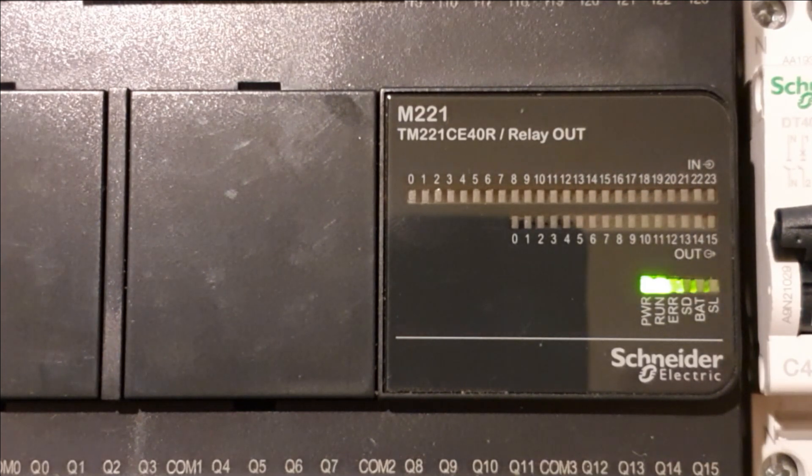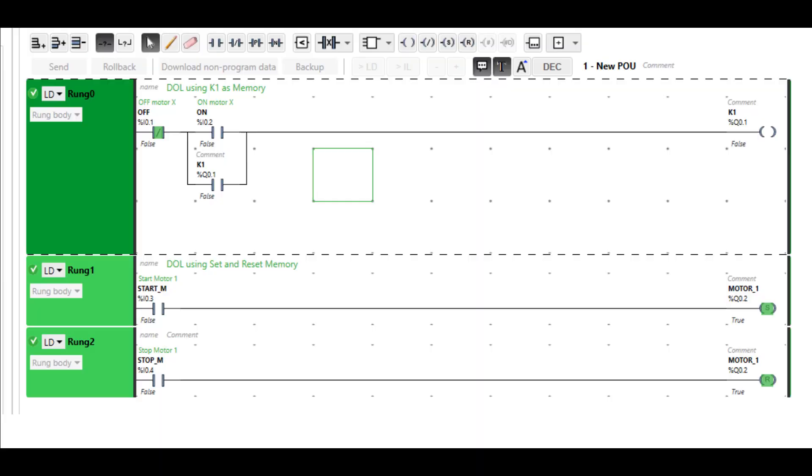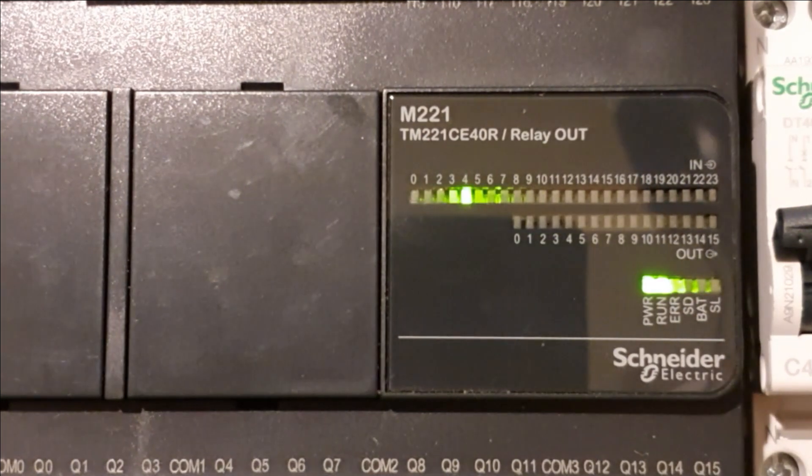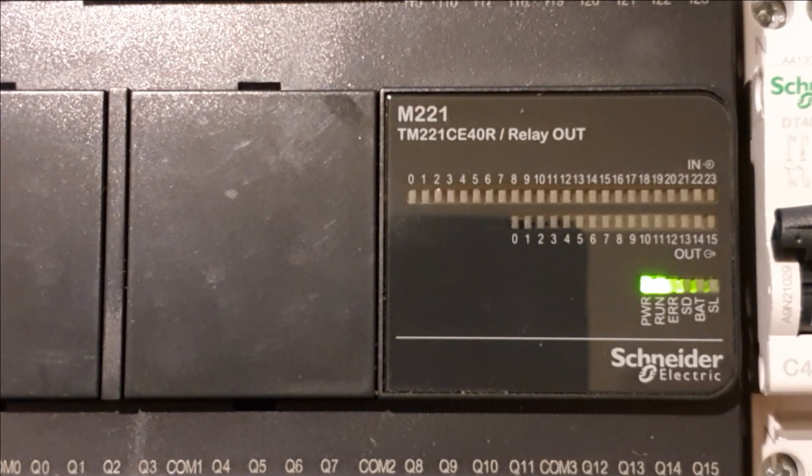This is the first rung — rung 0. Now I will show you the set and reset memory using SR. This is rung 0.1. The connection is made on input 0.3 and input 0.4 — input 0.3 is the SET and input 0.4 is the RESET. I activate input 0.3. As you can see, even when I remove the signal from the switch, Q0.2, the output relay, remains ON. To reset Q0.2 and switch it OFF, we just press input 0.4. This shows the basic hardware side of running a simple program on the PLC.